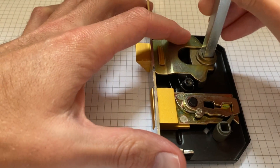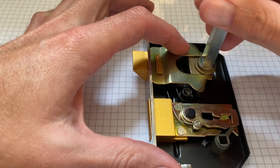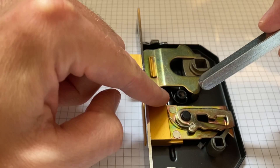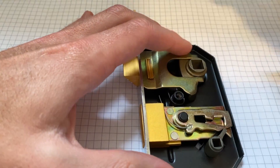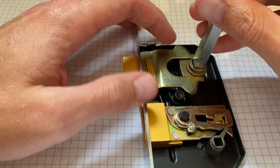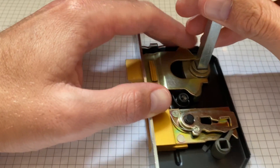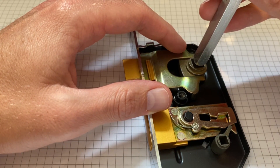The mechanism — this driver bar is the piece that goes through the handle on a door handle. I'm just having to hold it down here, because if any of you decide to take one of these apart at home, be careful. This spring you can see under here is under a lot of tension, so hence I'm having to hold this down. In reality, the other case half clamps it down nicely. You can basically see you've got an arm here, top and bottom, and the cam lets it rock.